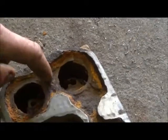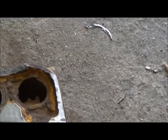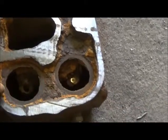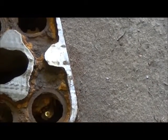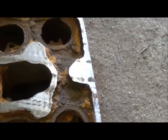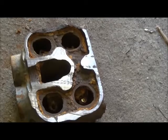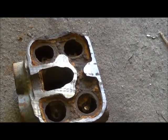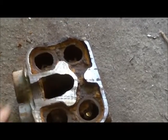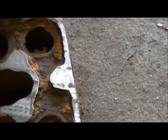All we've got to do is seal these apart from each other and seal everything off. There's a good wall in there, and I think we can do that. If we have to, we can drill and tap it with some small bolts. One way or the other we are going to get this taken care of. I'm probably going to mount this up on the horizontal mill — I've got some end mills and I think we can stack some cutters together on it, or just use one cutter and let it cut and move over. We'll figure it out. I could hit it with the grinder first to get some of this down — being cast, a good rough grinder disc will take it right down.